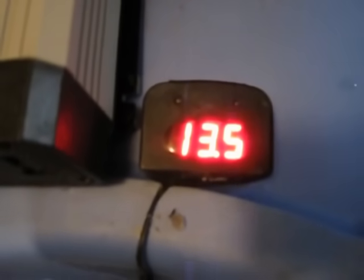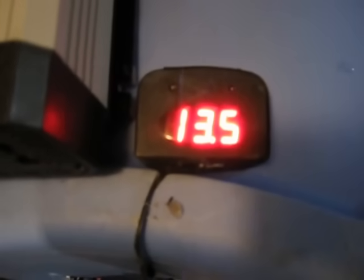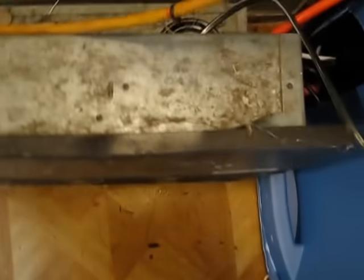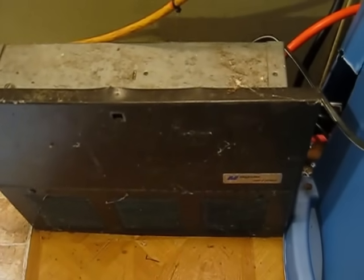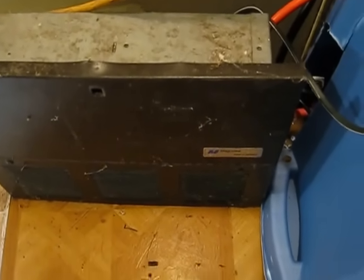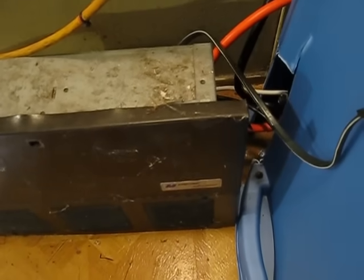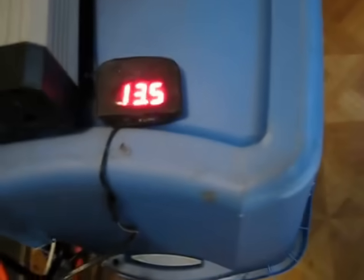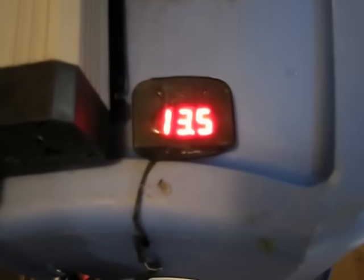This is inside the house. That is showing that I'm getting a charge into the battery right now. The wire from that alternator comes right into this charge controller from a camper — it was originally 110 volts and I've done some tinkering and reworked it. It still works on the 110-volt part, but it also has a small regulator inside that regulates it down to no less than about 14.5 volts. Right now it's showing 13.5 because the batteries were a little low.